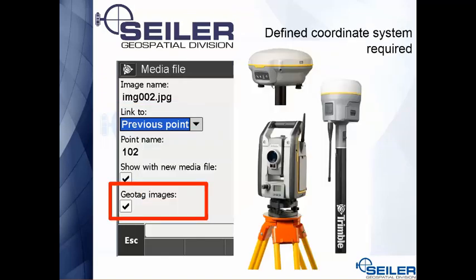The really handy thing is the geotag embedded in Trimble Access. If you're in a project that has a defined coordinate system — whether it's a total station or a GPS job — the latitude/longitude geotag being placed on the photos is the true position from your survey file, rather than just the one from the internal GPS in the TSC3.